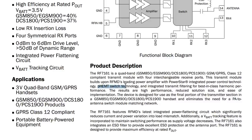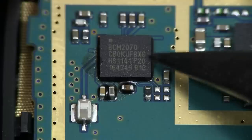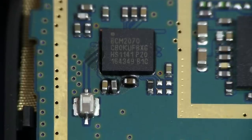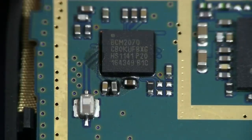It's got PHEMT switch technology — that stands for HEMT: High Electron Mobility Transistor. Wikipedia that one. And of course that system on chip was lacking one thing, and that was the Bluetooth capability. Which is handled here by this Broadcom BCM2070 — that's a Bluetooth 3.0 compatible module. That's all there is to it. But that's extra cost in this sort of phone. So you can see that this exact same model without Bluetooth capability — well, I don't know how much they're paying for that chip, maybe 50 cents in volume — you can shave that cost off.